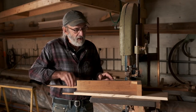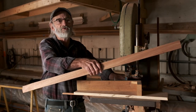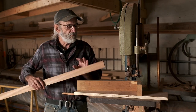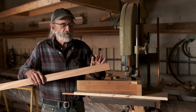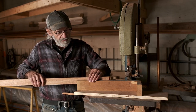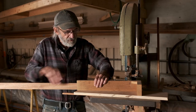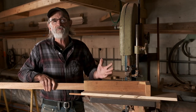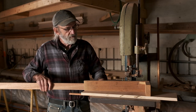Once the scarf is made — once you've cut through it — you stop and draw it back. You don't just keep pushing in that direction like you're cutting something on a table saw. That won't work either. So you push it in and you take it back. Also, this piece of wood that we're going to scarf is not going to be clamped to the jig, so you can't allow it to move on the jig whatsoever. It really isn't all that hard to do. You just put it up there and squeeze it nice and tight and when you cut it, it won't move.